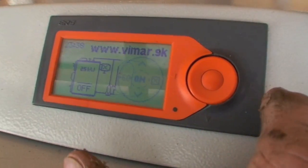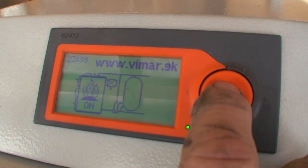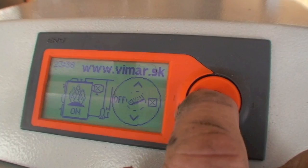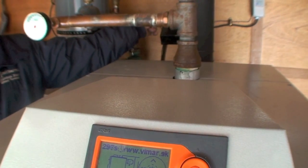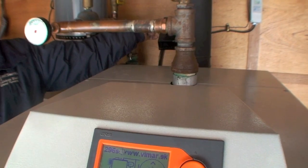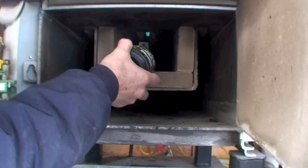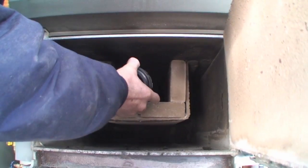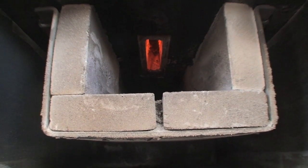We're going to press the center display on, waiting for the firewood to come up. Press the firewood — this starts the inducer and shuts off the combustion fan. Now we're creating good draft using the inducer. Open the lower door. Take the butane torch and for 30 seconds hold it up into the nozzle to ignite the charcoal. This creates a venturi and helps ignite the existing charcoal.